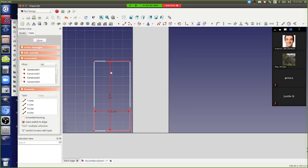I think I still don't understand. This is being cut from a 2x12. Yeah, it could be enough so that when you put it in, your joist will not be twisting. If it's 11.25 and you put this in straight, then no way can your joist be twisted. If it's too short, like cut out of a 2x4, well, actually a 2x4 is quite convenient because we don't need to waste 2x12s. If it's like 3.5 inches. 3.5 inches, yeah, that's perfect.